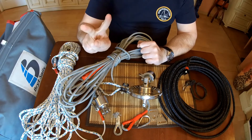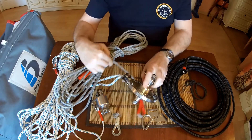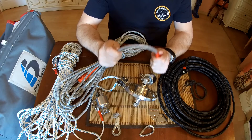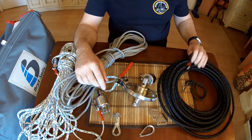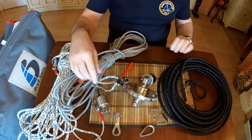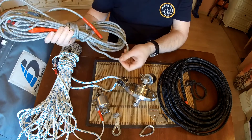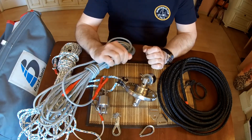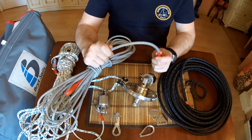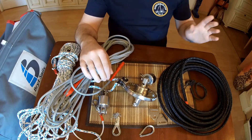I would like to focus on two very important points. First, it's no use trying to save on the quality of the rope, nor on its diameter. I once made this stay out of a 6mm anti-torsion cable, which was obviously insufficient for a 12.5m mast, which required more solid rope — around 10mm. So the rope did twist, and you may still notice the traces of it, and the furler didn't always work as it should have. A 6mm cable is suitable for a boat of 5-6m. For a 7-8m yacht, it is worth choosing an 8mm cable. And for boats measuring 9-10m, it is desirable to take 10-11mm.